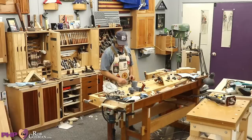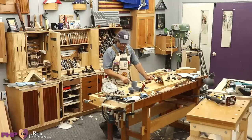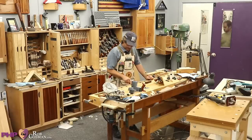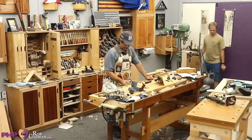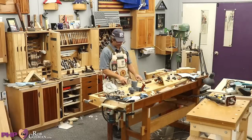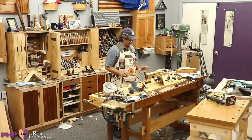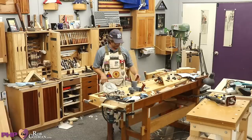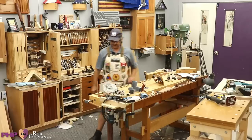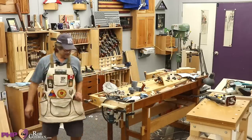Then you glue the extra piece on to create a nice captured hole. If you tried to mortise those out, it'd be there forever. All those slots are cut with the dado, then this piece is added on. I always put two eighth-inch splines — one about a half inch below the surface on each edge — with corresponding grooves on the other piece, so when you put it together everything lines up nicely. Done.